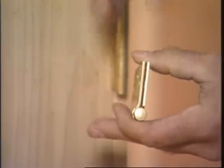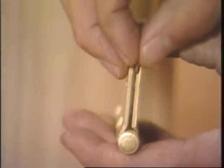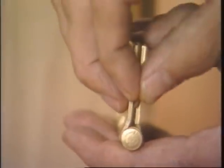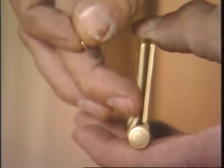When the leaves are closed they'll be parallel — that's a parallel joint — but they're not always like that. You need to check your hinges for swage because you might have to make the mortise a little deep or a little shallow to control the margin on the side.